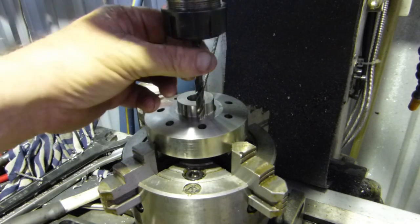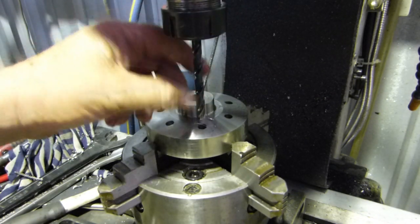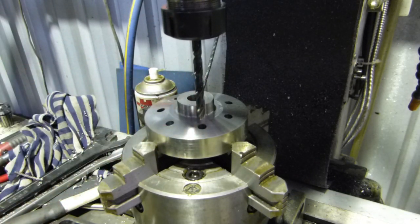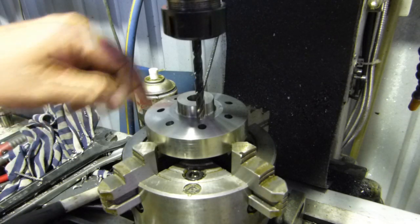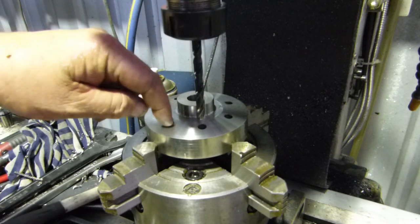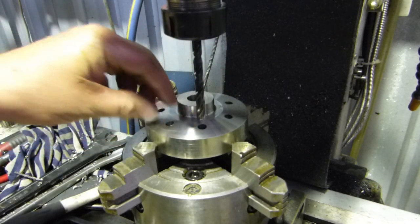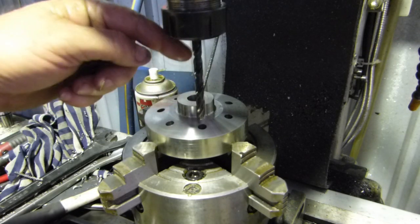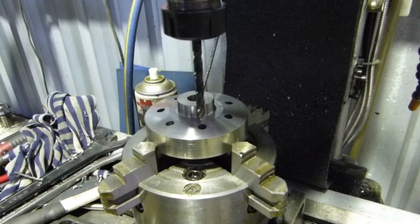I think it's a 19/64th drill. You know why we use that size drill? Very important. I went and had a look at the drill thing and that looked to be the sharpest one in the caddy. All right, I'll go and get the end mill now. The end mills I had weren't center cutting, so by putting a cut in them we should be able to get a nice rigid run straight down the middle and have it clear and have a nice hole come out. So we'll go and get set up for that.